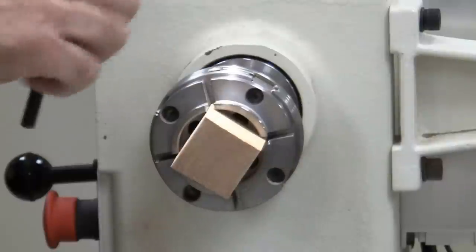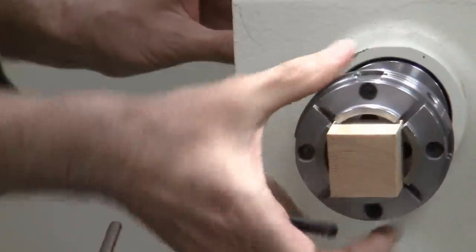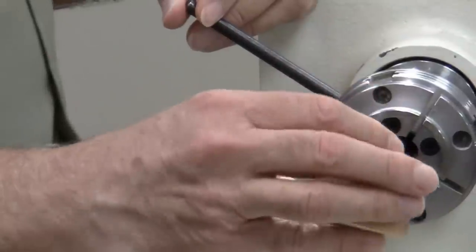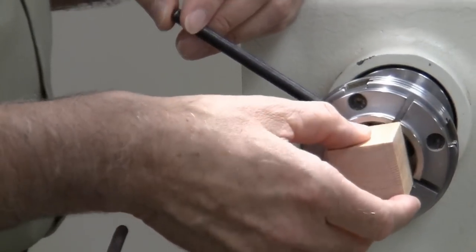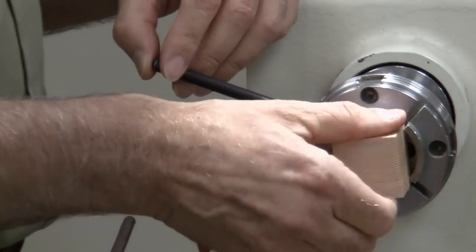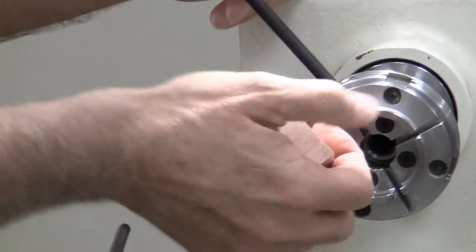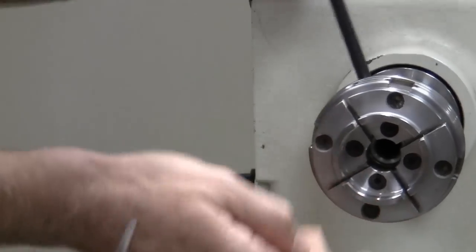This chuck is really easy to use once you get used to it, especially if your lathe has a spindle lock. I started out with a Talon one-way chuck, then got the Nova G3. The Talon was made in Canada, the Nova G3 down in Australia — with the equator difference, one tightens one way and the other the opposite, which was frustrating. With this Tommy bar chuck, the only thing to remember is: push one way the jaws go in, the other way they come out. That's it.